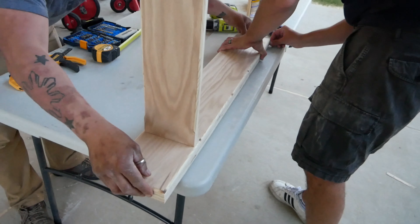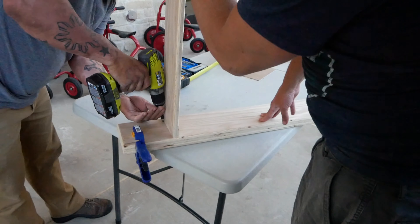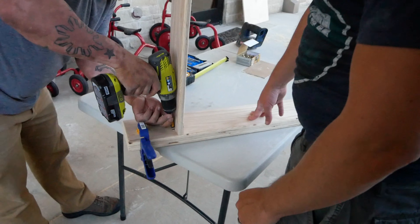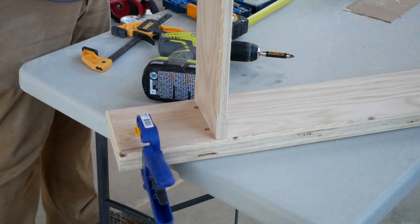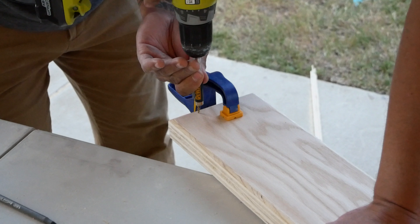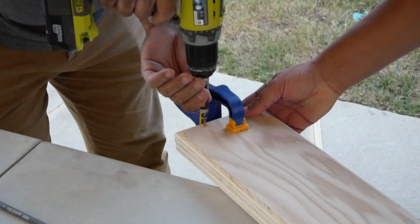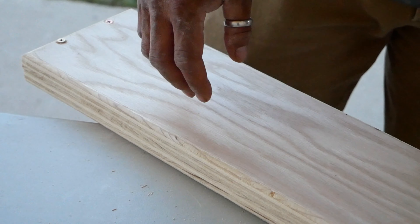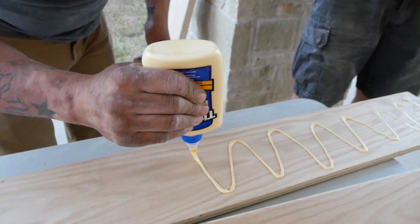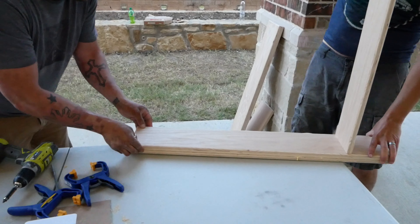Now the table's on its side. We added extra support by putting two screws into the beams right under the shelf and at the very top of the base where the table top would go, and that way these screws are hidden. So when it's standing upright, you won't even see them. Voila! This is what I was talking about when I said maybe we should have waited to attach the two pieces of the top of the table together, because then we would have been able to hide the screws in the same way.